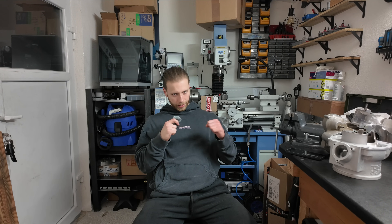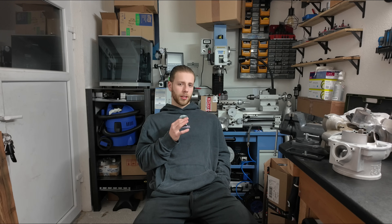Using a belt should also make the engine last longer than a thousand kilometers, because the belt may absorb some of the energy from the two 700cc cylinders working against each other. I've seen a lot of people connect multiple cylinders by a belt and it works — it has its own character and it looks good. On a Harley Davidson, the open belt drive primary is nothing else. In my case there are just two crankshafts instead of one, so I don't see any problem with this setup.